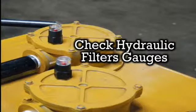Check and inspect all hydraulic pumps, motors, and hoses for leaks and abrasions or any signs of wear. Check and inspect all tires as well as all gas lines on the upper deck and furnace decks. Check the burner tips inside the all-gas vaporizers. Inspect the steering cylinders and brake lines.